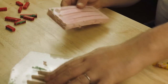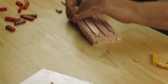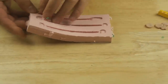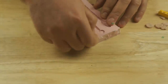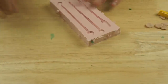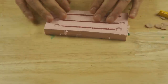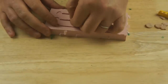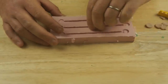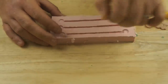And there's my worms. Take out my little bits there, my pouring points, and these little bits here, I can just snap these off. Just looking at it, there looks to be a tiny bit here that's really thin stuff that's crept underneath. But that can just be pulled off. And I would say my mould's ready. And I can go and get my stuff for pouring.